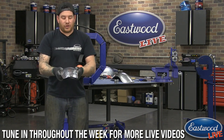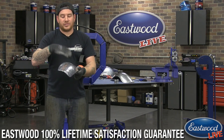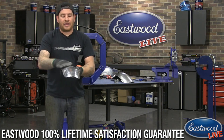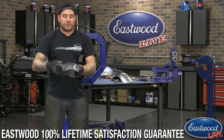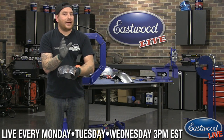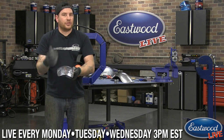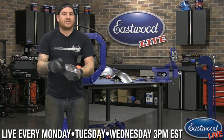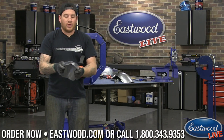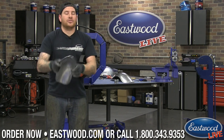I used the English wheel early on in the process when the panel wasn't as curved to just planish it out a little bit. But now that we're into a heavier shape, our lower wheels would end up hitting on both sides. So if you have a real, real high crown, narrower wheel, you could get away with doing this. The process does take a little bit longer with the English wheel because you have to just roll, tighten a little bit, roll. And with the planishing hammer, it's nice. You can just buzz along.